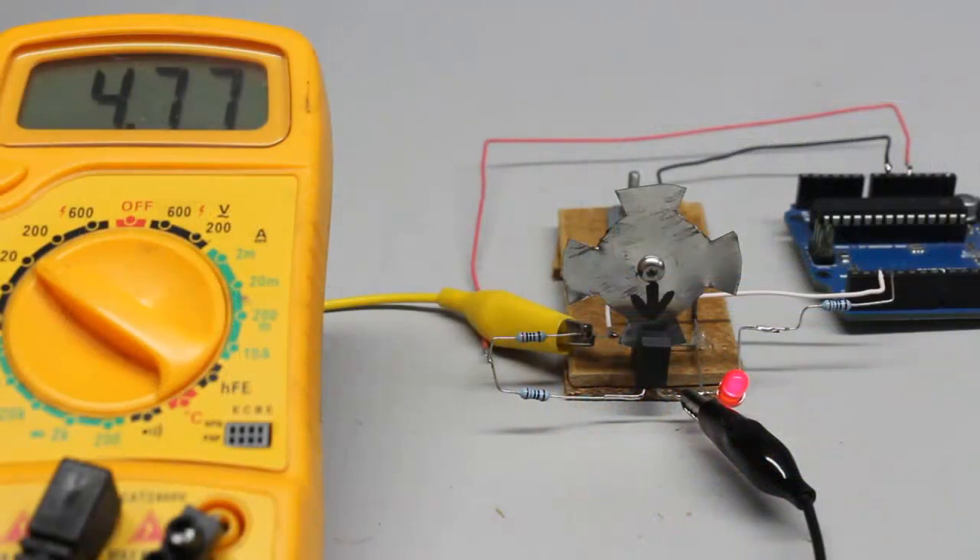With a toothed metal disk, a microcontroller can detect rotational movement. The terminal marked with the plus at the phototransistor has to be connected to an input pin of the Arduino; minus of the sensor unit must be connected to the ground pin. The sensor disk has 4 teeth. In the initial state, a tooth blocks the infrared light, so plus 5V can be detected at the input pin of the Arduino, which is called a high signal.